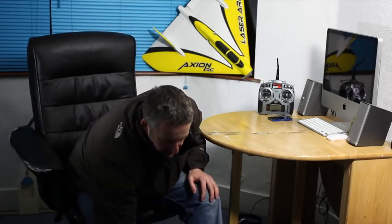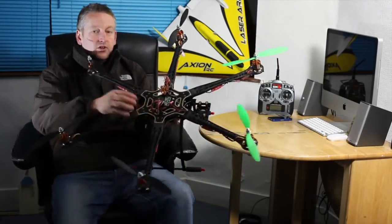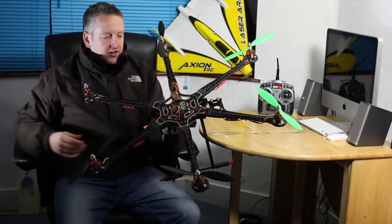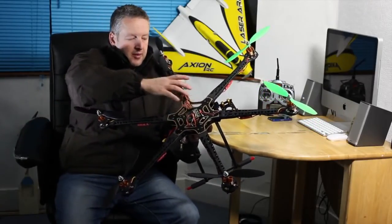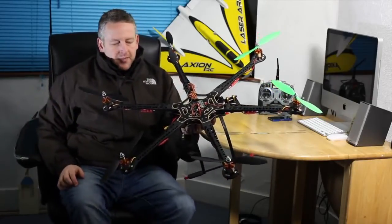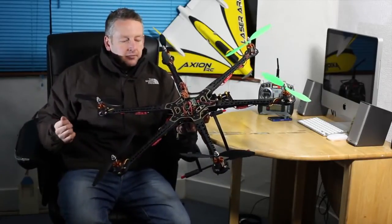So here she is, as you saw in the video. You saw when I took off, you heard it screaming out straight away. We forgot to set the voltage on the KK2, so the piezo was immediately going off, telling us something was wrong with the battery. So we just quickly landed, popped that off.